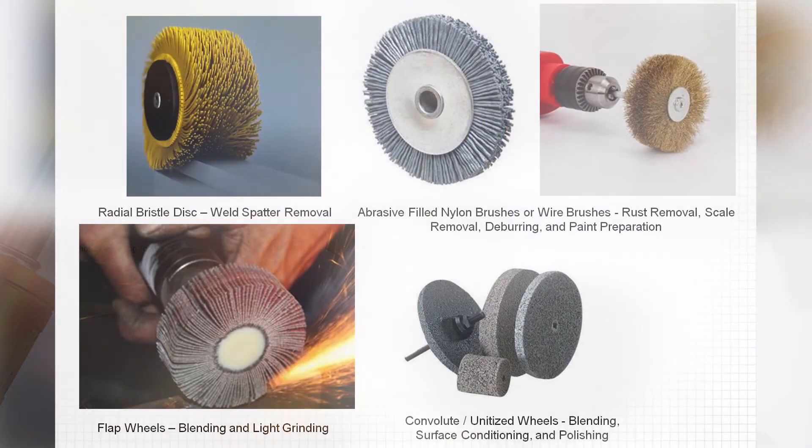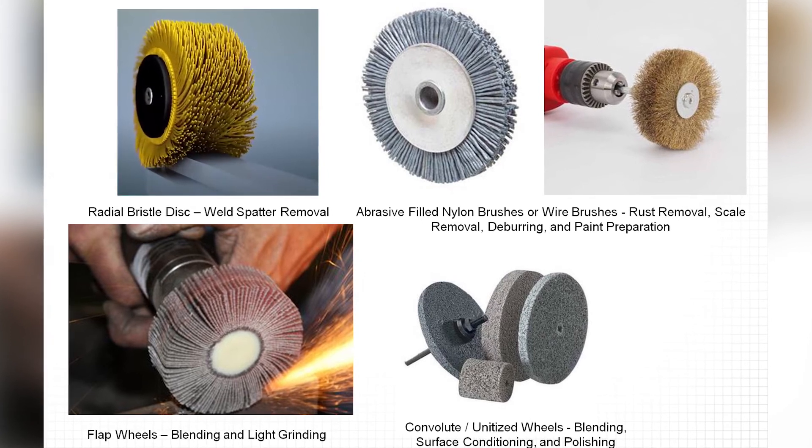What are some unique features of the RCE 710? The variable, controllable speed is really a highlight of this tool. By being able to control the speed, you can optimally set this tool for different types of media, both in their use and wear. A flap wheel, a carbide burr, and a brush are a few types that can be used, and they all work optimally at different speeds. A built-in feature is increased process verification with speed sensing — you can make sure that the speed you've set the tool to is what you're actually operating at, and you can feed out and capture that data.